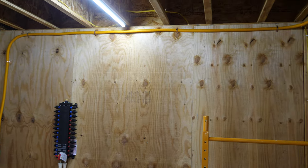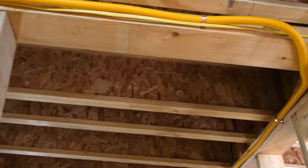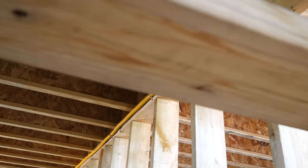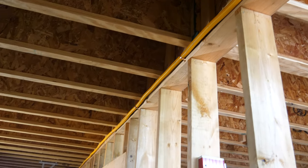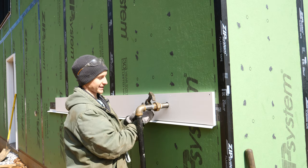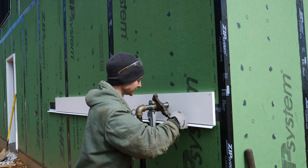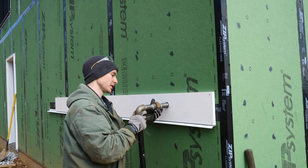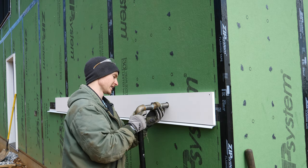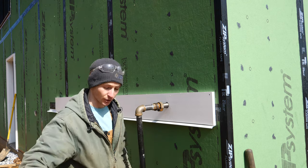Here's the whole run. The best part about CSST is I don't have to worry about any leaks other than at the beginning and the end. I just love undoing work simply to redo it again. I'm almost going to put money that this union is the culprit. Actually it looks pretty well sealed — maybe my pipe dope actually hurt me on this. I'm going to clean it off.